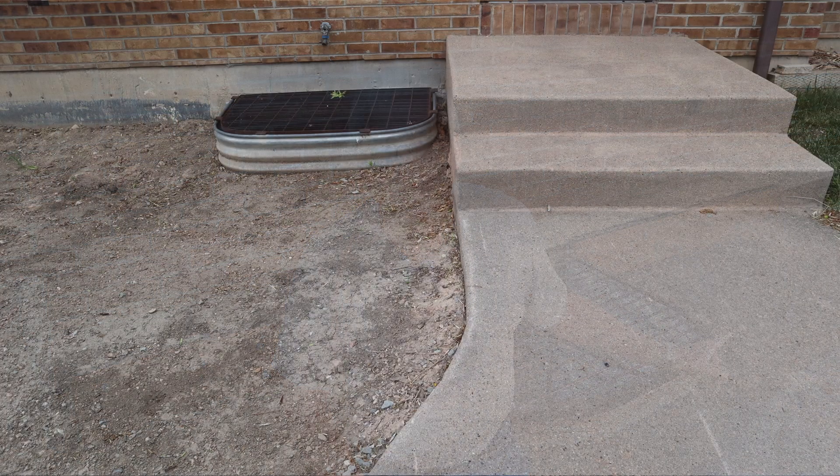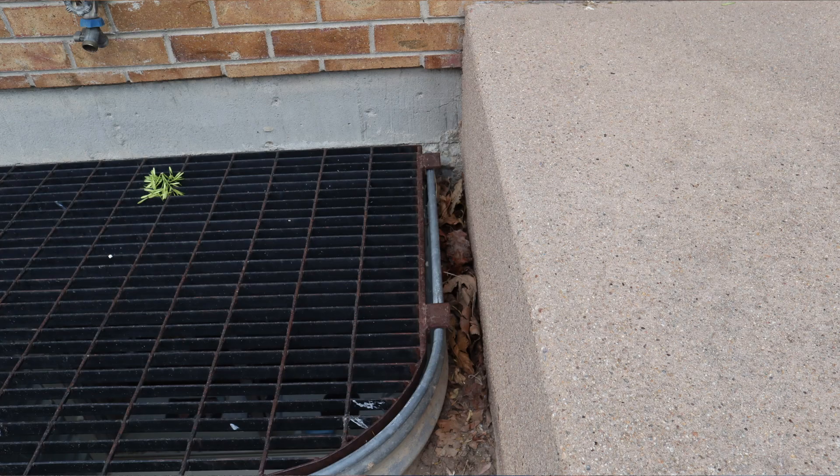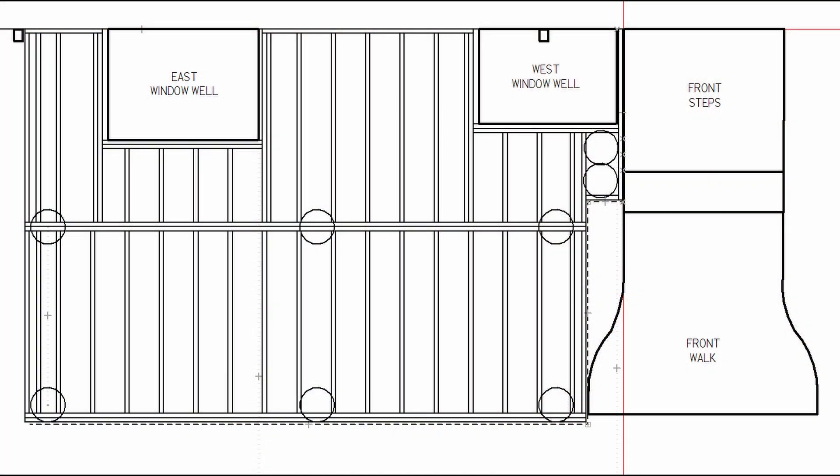The far end of our deck does not have enough space to install a ledger board, so instead I will attach a bracket that I will fabricate from steel. In my last video, I described the design of my deck, which resulted in this drawing. Though I will frame this deck with treated 2x8s, I made the ledger board using a treated 2x10.